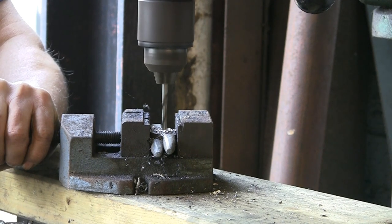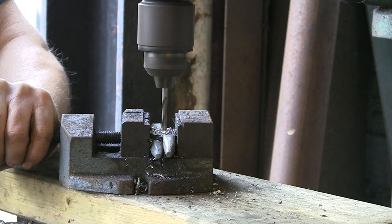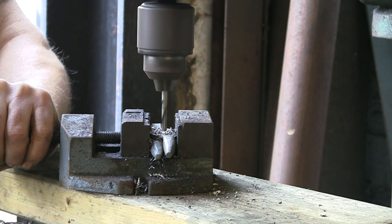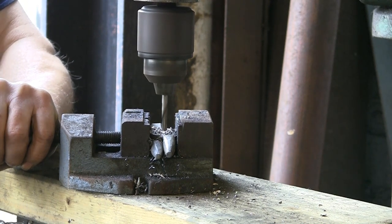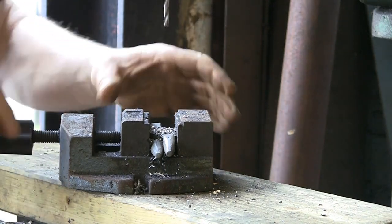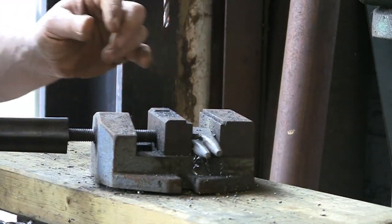Yeah, definitely gone a bit hard, that second one. You often find that happens if you quench something out at sort of orange, a bit of mild steel, it will actually slightly case harden it, which is good for some jobs, but other times it's a bit of a pain, like now. It's gone a bit hard. Never mind. There's your pilot.